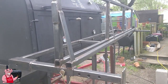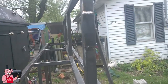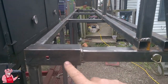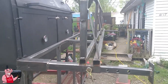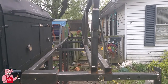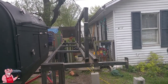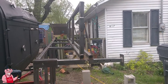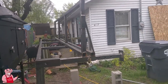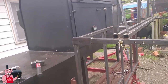I had originally intended on each end to gusset it out from the side. In fact, I even welded a pad here to make it even with the angle iron. But then I thought better of it. The reason I'm not going to do it is because I can just see somebody coming down off that and trying to cut the corner, catching that gusset with their shoe foot and taking a good spill. And who knows — it might even be me. So that's the reason why I thought better of it.